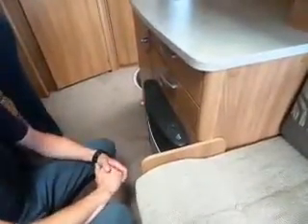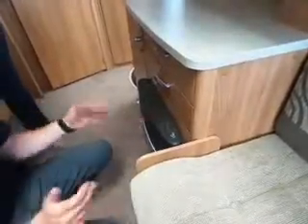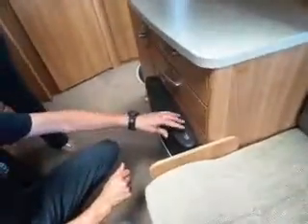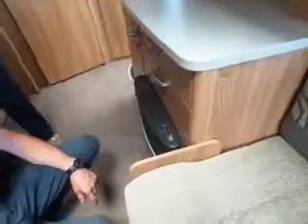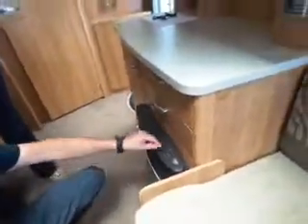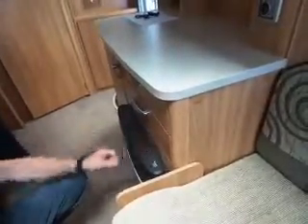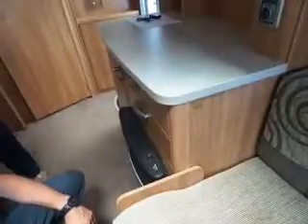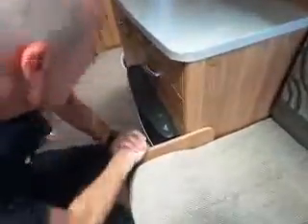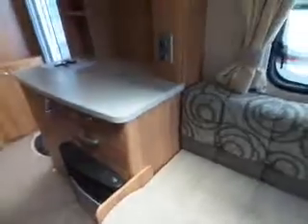The gas side is more efficient, but once you've heated it up on electric - which may take a little bit longer - the insulation on these vans tends to hold the heat quite well, especially in a smaller van. This side is your fan - it works independently of both energy sources. It's always best to use the fan when you've got the heater on as it will blow the heat out the vents, including in the bathroom. Centre to the right is automatic thermostatic control; manual is the other side. You can also use the fan without any heat to just circulate the air.